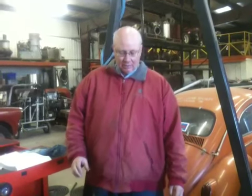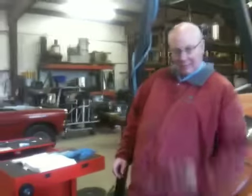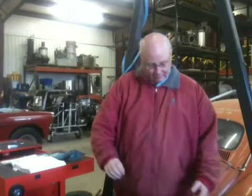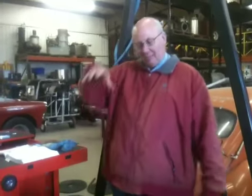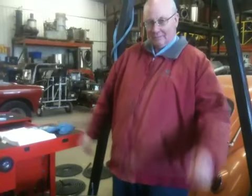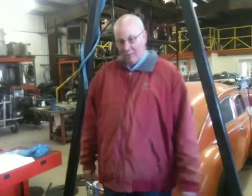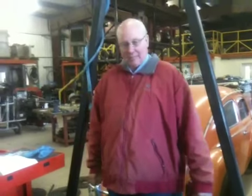But it's a lot easier to just pump the water from the bottom up, and the heat comes from the top down. Simply because at the top it's going to be turning to vapor. Well, simply because water's heavier and it's nice to use gravity when you're making these things. It's a lot simpler to have gravity on your side instead of fighting it. So that's why you design them the way you design them. So you don't have the heat from the bottom.